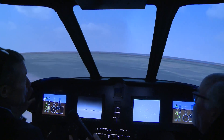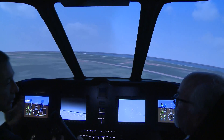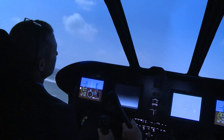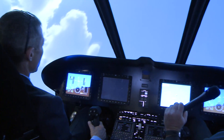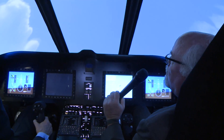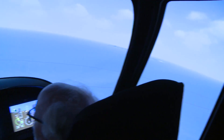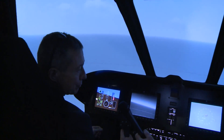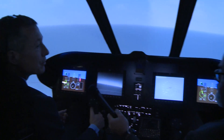It is a carefree handling qualities aircraft. With the fly-by-wire, we're able to limit its G loading, its flapping, and everything else, so you're able to really maneuver the air vehicle quite hands-free. We can pull it up — if you look out your right door you can see your climb angle right there. We're in airplane mode now. You transitioned from helicopter to airplane mode very smoothly. Exactly — with the combination of wing lift and rotor lift back to wing lift, I'm able to convert energy very easily. So we just went from a takeoff, accelerated out to about 220 knots, then popped up here at about a 3,000-foot hover. We've got about 16 knots of ground speed aft just sitting up here.